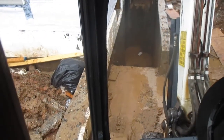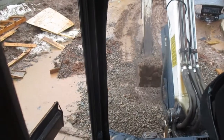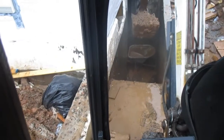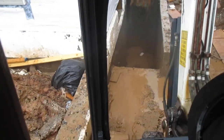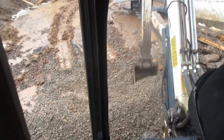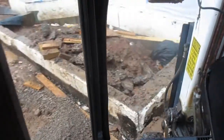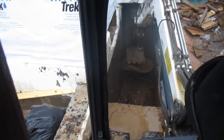As the rains began, we got our load of recycled stone. The T-140 was walking it into the backyard, and I was picking it up with a 20-inch bucket and dumping it into wheelbarrows to speed up the process. We brought in about 28 to 30 yards of stone to bring this basement up to the proper height. We ended up having to cover the pipes so the insulation board sat flat. We'll get into that more in a few moments.